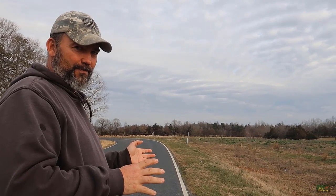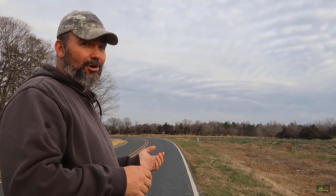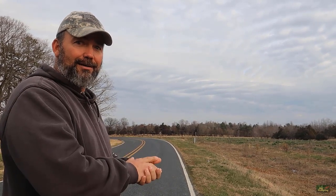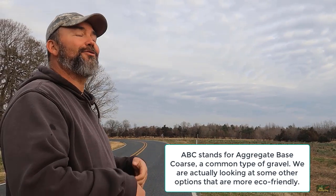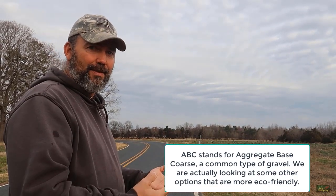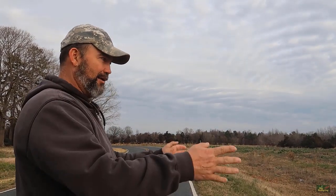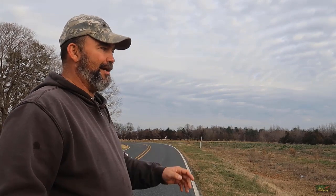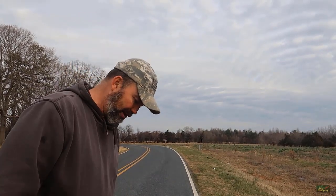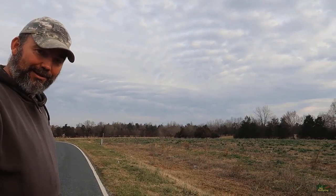Okay. But the water seeps through, it's permeable. If it gets wet, it's not. You don't really want it to. It comes like concrete, the ABC stone does. And that's where you can continuously drive over it and it packs. If this is good red soil, which kind of looks that way, then we just cut the grass off of it, put it down, keep the water off the driveway, and put your ABC down, and then it packs hard. That's what's underneath the roads, before they put the asphalt down.